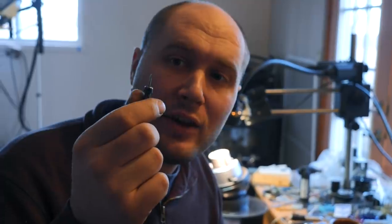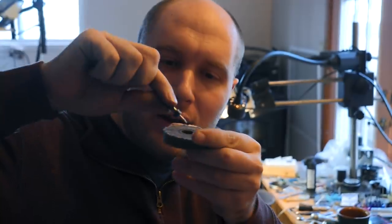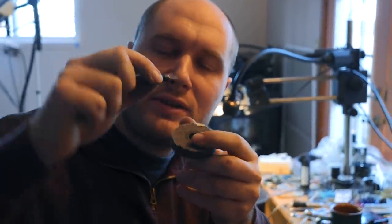This is the little spade cutter that I use to dovetail the groove that the gold's gonna go into. The dovetail will let the gold fill into the dovetail and lock it in place. And I come in on the side of the groove and make these little marks.